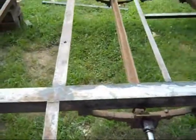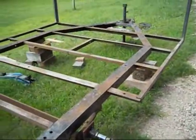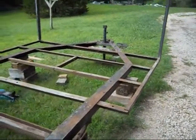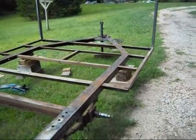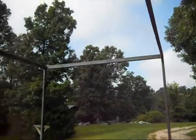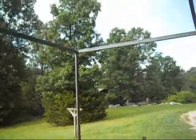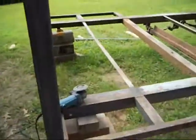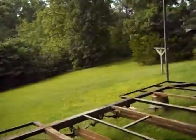Today's goal is to get this frame painted and put the subfloor down. It's been a couple of weeks since my last update because I've been doing a lot of thinking and deciding, going back and forth on how I wanted to do this. But I finally decided to do an outside steel frame. I've got the four posts, and across the top to the back corner it's all inch and a half by three inch, eighth inch thick tubing. It's all welded up. It's good and solid.